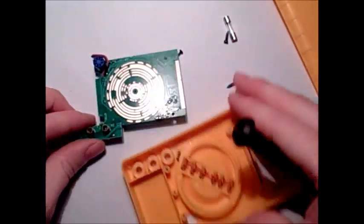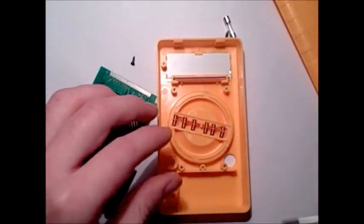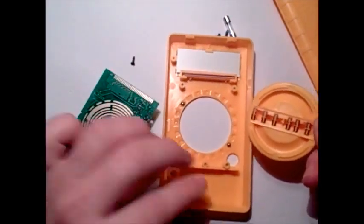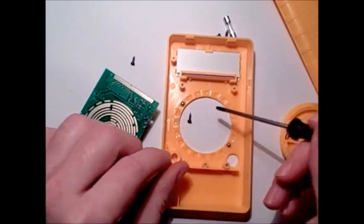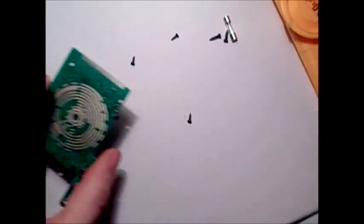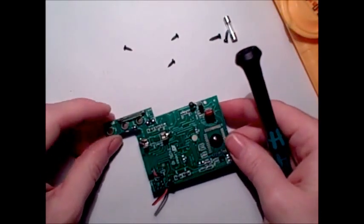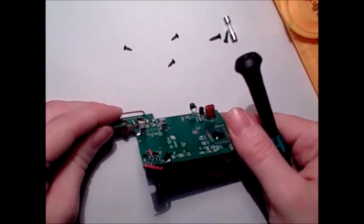You could actually put a meter across that. It's got similar brush-stroke terminals to what the Flukes have. They've put ball bearings inside here too, so it gives that nice clicky sound — it even sounds like a Fluke meter. But generally speaking, there's not a lot on this board. Certainly no high-quality input protection, apart from that PTC, I suppose.